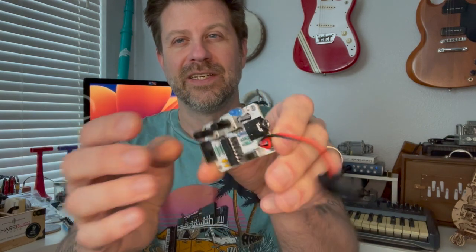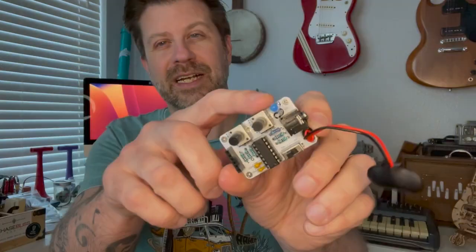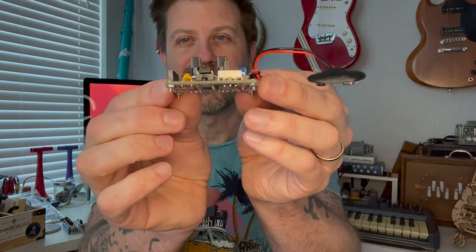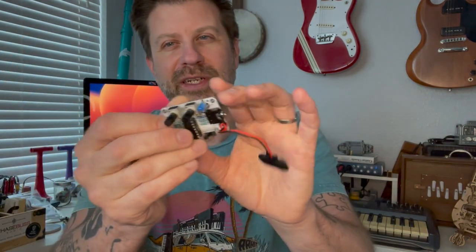I also did a couple of my own modifications. I noticed it didn't have an LED for power so I added one — I added a blue LED to the audio out jack, since it comes with a small speaker option which I didn't use. I found that a five-millimeter blue LED worked really well; different LED colors have different voltage requirements, and it was a happy accident because blue kind of goes with the Racket aesthetic. Also, this one didn't have any standoffs so I just took four small screws and put them in there so the ends on the bottom don't ground out on a conductive surface. But let's hear what this thing sounds like.